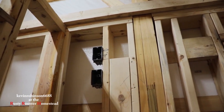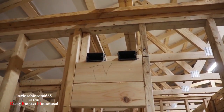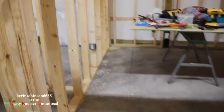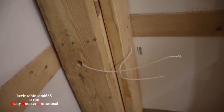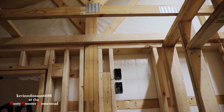So we have them in, and here's how our boxes are going to go up here. The bottom one is going to be for the electricity. The top one is going to be for the coaxial wire — the antenna wire. The one on the left will be for the coaxial and the one on the right will be for the power. Light switches are in and outlets are in both these rooms and all of the holes are drilled all the way around. We also did this corner the same way — put a piece of 12-2 scrap wire through there and tied them off. When we're ready to put our 12-2 in, we'll just tape it to the wire and pull it through.